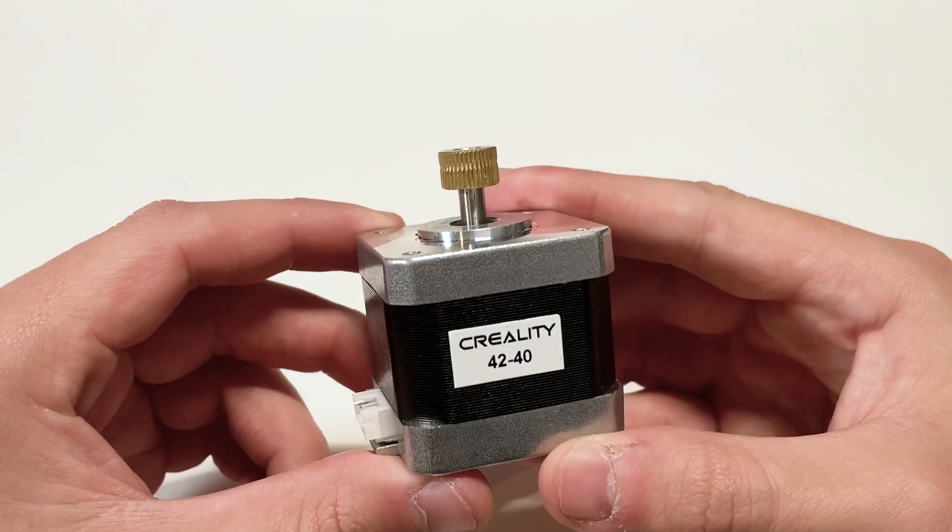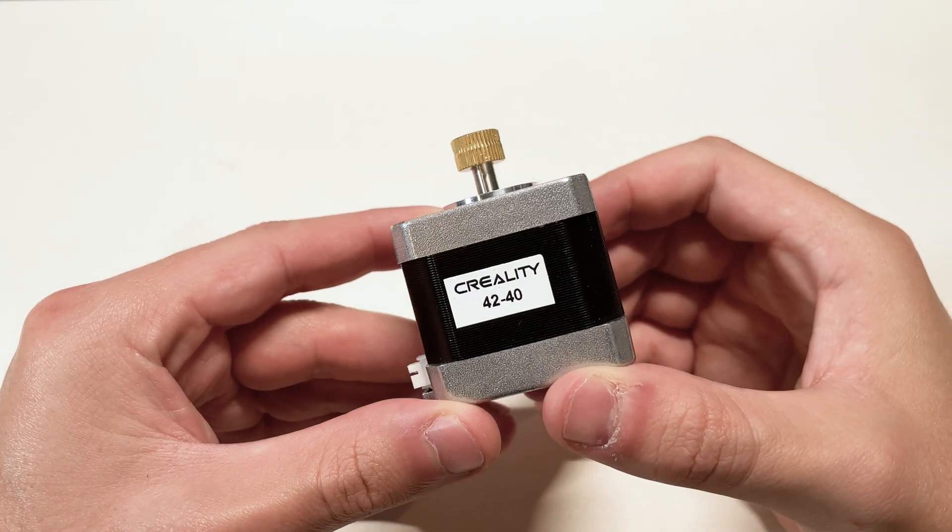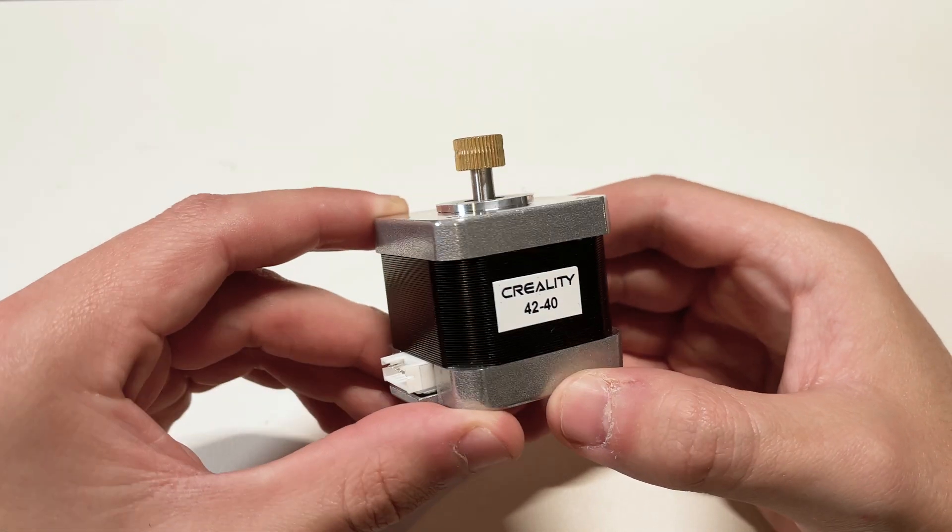This problem became much more clear, especially during retractions. So I removed the stepper motor and sure enough, the extruder gear on my stepper motor had worn out. When this gear wears out, that's when problems start to happen within your prints. When I realized that my stepper motor gear had worn out completely, the only simple fix to this problem is replacing it with a completely new gear.